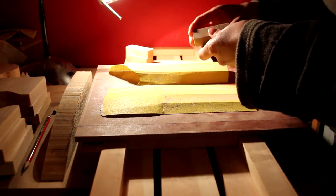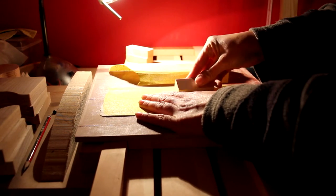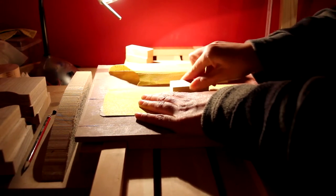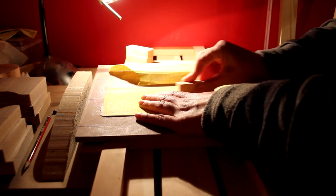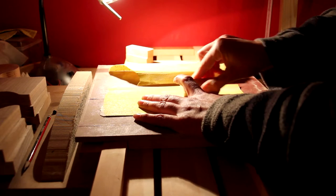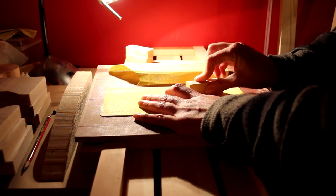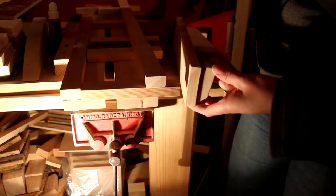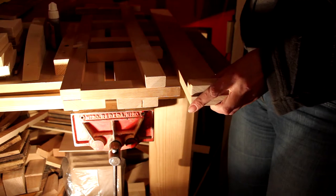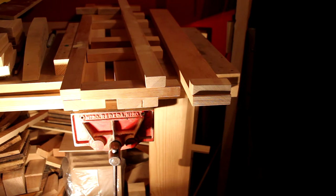As part of the design, I added a couple of small blocks underneath the end of the bottom layer. These were the offcuts left when I cut the bottom strips down. Below the bottom layer, there's a couple of pieces to stop the caddy sliding off the bath. This won't actually stop it sliding off the bath, the other block will do that, but it'll stop it twisting when in place and it'll make it look quite nice. These were glued on, but they'll be strengthened later on by a dowel.